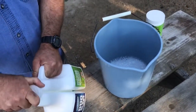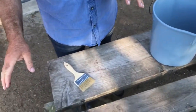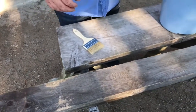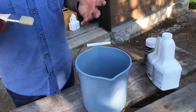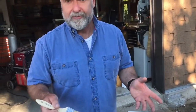I want to show you how it works on some of this weathered wood. There's grey weathering here, there's some mildew, there might be some mould. I'm always surprised at how well these oxygen based cleaners work — they brighten the wood but they also don't remove the natural wood grain patterns. So in a sense, not only are they safer than bleach, but these oxygen based products actually do a better job.